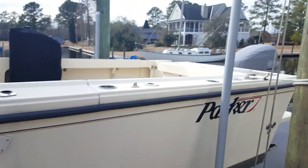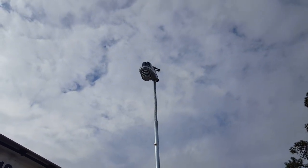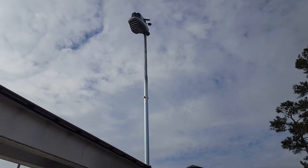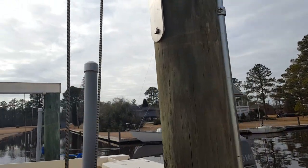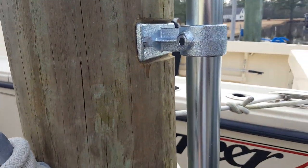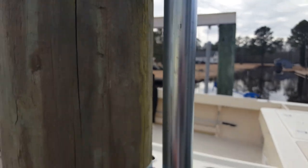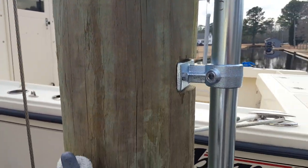One other quick thing I did this year was add a weather station. That's an Accurite Atlas Six Function Weather Station, and there's a screen that sends all the data remotely into the house — wind speed, wind direction, humidity, lightning strikes, all kinds of data. We are in a hurricane zone here, so I had to get three heavy brackets and cut and groove every one of them because it has to be perfectly level and square. I put three brackets on, and I can just loosen these three set screws and lower the pipe right down where I can reach the unit from the boat to change the batteries. I use lithium batteries, which should be good for about a year.